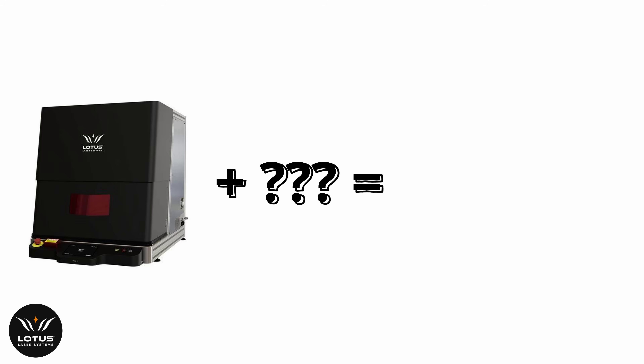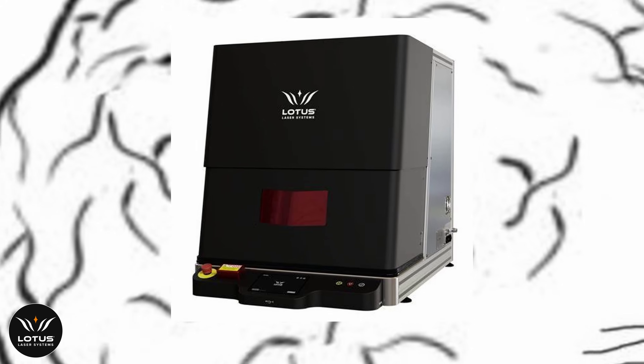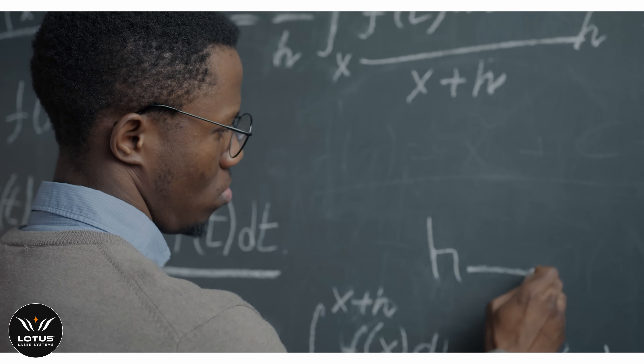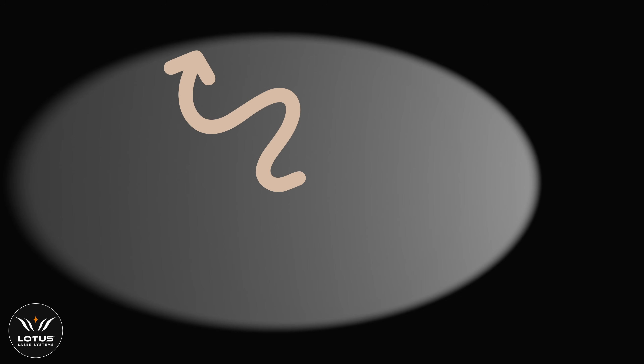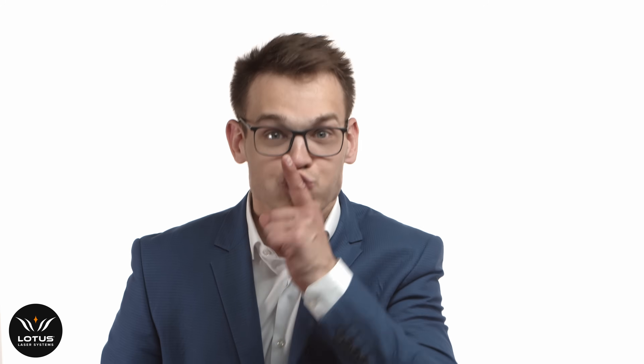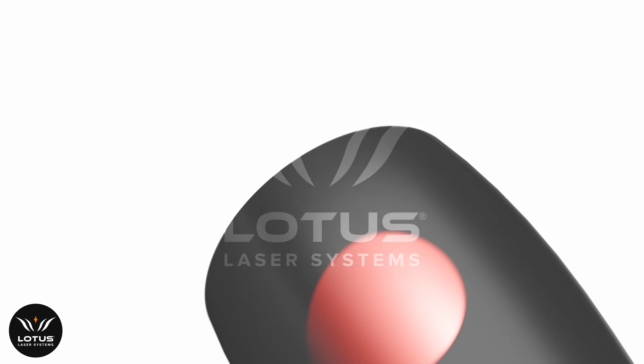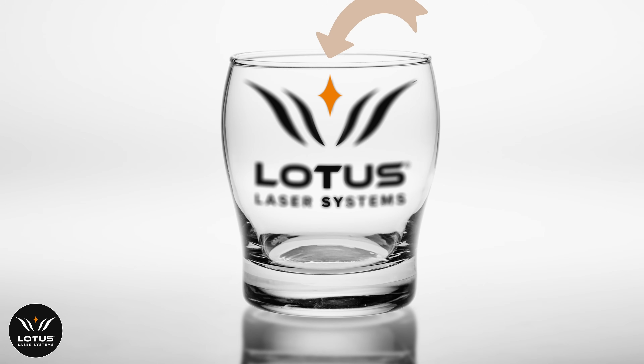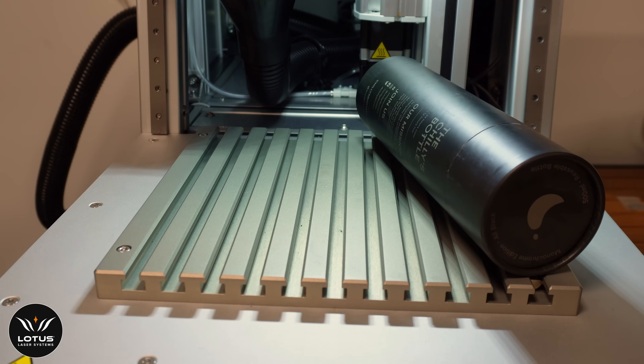Buying a 3D laser does not mean you'll instantly get perfect results, because using a laser is 20% technology and 80% knowing how to use that technology. We need to go back to physics class and talk about angle of incidence. Shine a torch straight down and you get a perfect circle that's nice and sharp. Shine a torch at an angle and you get a weird ellipse with diffused edges and uneven brightness — and what a lot of manufacturers fail to tell you is that lasers do the exact same thing, even the 3D ones. Shining a laser down the side of a curved object is going to create a blurry blob instead of a sharp spot. Do that thousands of times across a glass and you get a logo that's sharp in the middle and blurry at the edges.